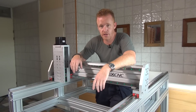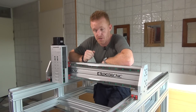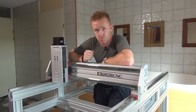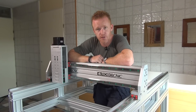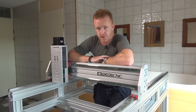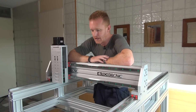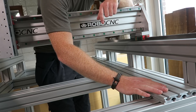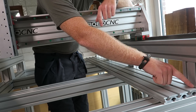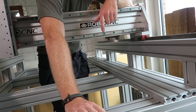One of the questions I have for you guys: I'm planning to use aluminum T-slot profiling as the machine bed, but I'm still not sure if that's the right choice since a wooden bed is quite practical too. I may make some modular pieces. The aluminum profile I'm going with is this item bed profile — it's really flat and has T-slots, so I can easily mount it on the bottom frame.